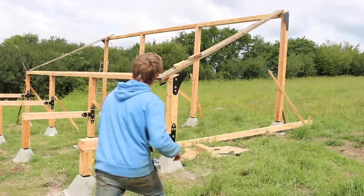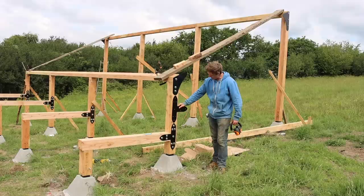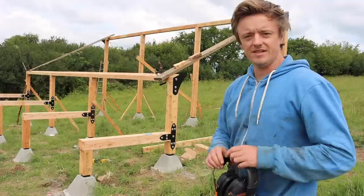So instead now, that one at the far end is going in line with the original idea, and then this one is going to have another bracket in here raising it up, so they'll be odd but they'll be more alike because they'll be more similar heights against the posts at the back. So yeah, I'm gonna do that. I'm gonna get the two timbers machined down through the planer thicknesser and then get them fitted.